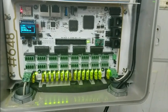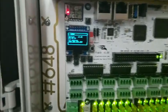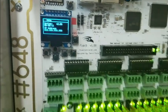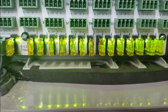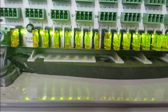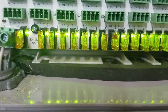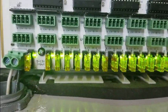We have applied power on both sides. I haven't done any of the setup yet — it's showing no IP address. Did just notice port 8 is not lighting up. I swapped fuses between 8 and 9, and when I moved the fuse from 8 to 9, it lit up on 9. The fuse from 9 did not light up on 8. So I don't know if I've got a light that's out or possibly a bad port. I have to do some digging. More to come.